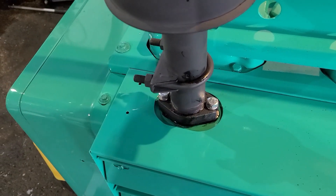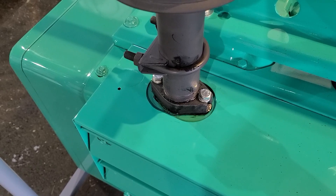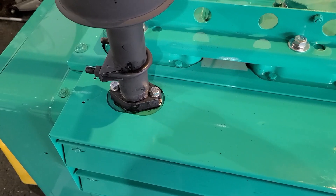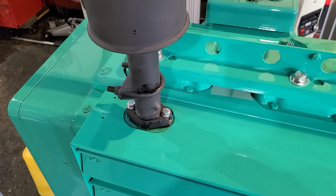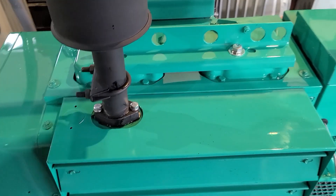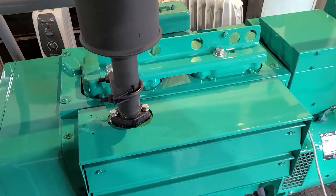I believe it's not oil — the oil base is full of oil, I checked the level. It doesn't really smell like diesel fuel. I believe it's just a byproduct of what's coming out of the cylinders trying to make its way out of the stack. There are some little splatters over here. When running unloaded, this stuff goes back into the exhaust manifold, eventually cooks, and starts closing up the exhaust ports on the head area — like clogged arteries — becoming a hard substance. I've cleaned this out on several DJCs with a blaster and sometimes it's pretty bad.